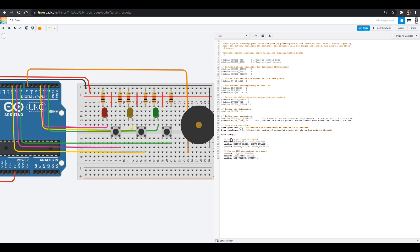Now we need to set up our program in void setup, putting in all of our pin modes. Our buttons are going to be inputs, our LEDs are going to be outputs so it can turn them on, and our buzzer is also going to be an output. If we wanted to make sure the whole program is working, we could call a test right after we declare this. The University of Wyoming has a great way to do that — they call play winner. You'll notice this calls some other little programs — these are miniature programs that we write down below as well.